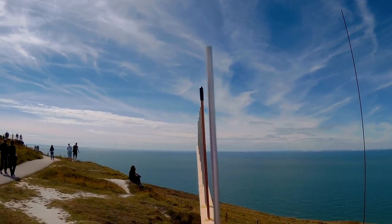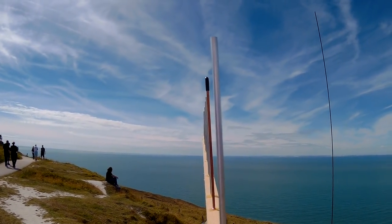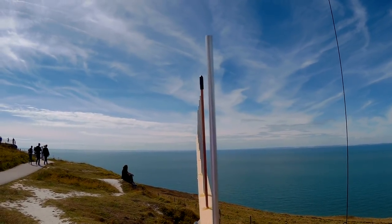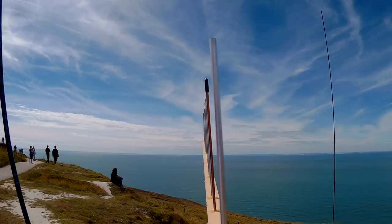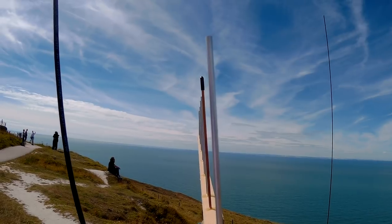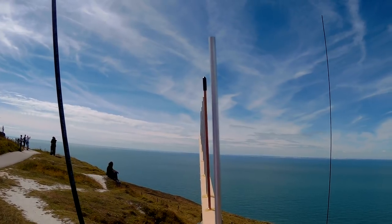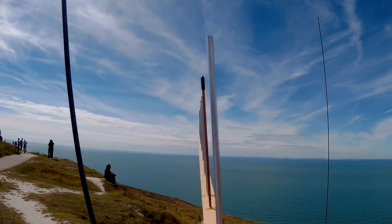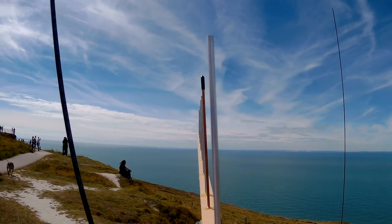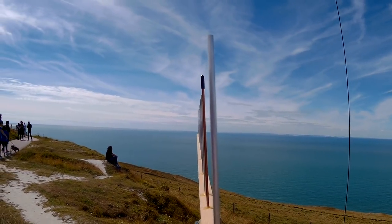Okay, well, it's sitting on the bench at the moment, but it will be operational hopefully within a couple of weeks. But understand about the channel spacing on your radio. Okay, 73's G8PUO. Okay, well, if it's on the bench, that must be another one that I saw on the internet. But hey, maybe when you set up the frequency, you can keep that in mind, 25 kilohertz steps, and that would allow a lot of military radios to use the repeater. And also, with the 150 hertz CTCSS tone, which all those radios all have. So just an idea. Back to you. Over.